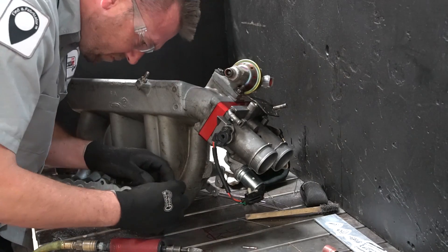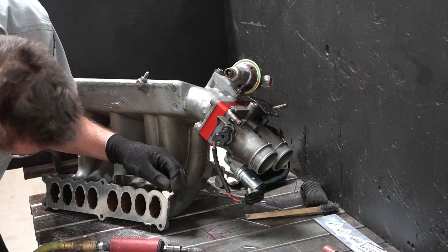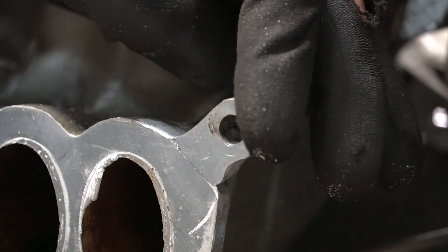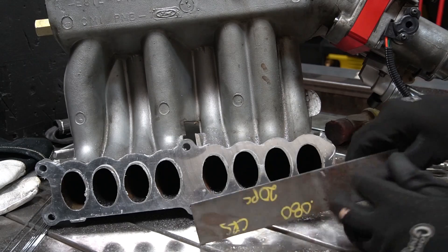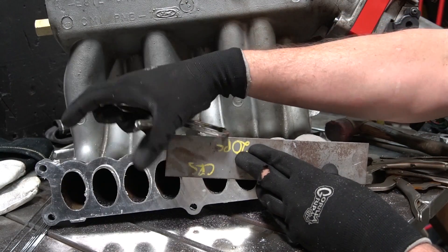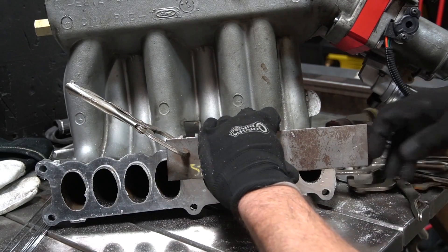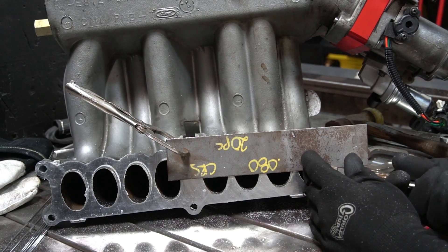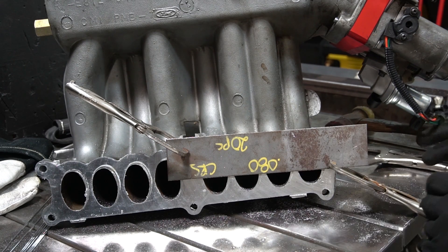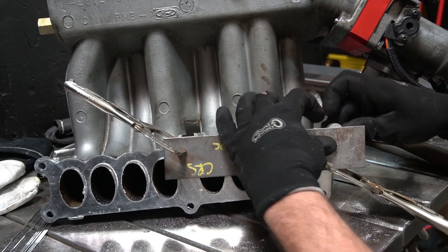The purpose of not cleaning off that layer — as you can see here as I wiggle it — it actually stays in place. It's kind of like a mechanical lock. One side is negative, one side is positive, and you can see that it goes back in almost the exact same place, extremely close within a tolerance. So I'm going to take a piece of flat stock — just some cold roll steel, about 80 thousandths or two millimeters. You need something strong enough to hold it in place but not super flimsy. I'm going to stretch this across that section, clamp on the little tab that broke off, make sure it's mechanically locked in right where it needs to go, and clamp it onto that sheet metal. This is going to help hold all of it in place while I give it a nice good tack weld.